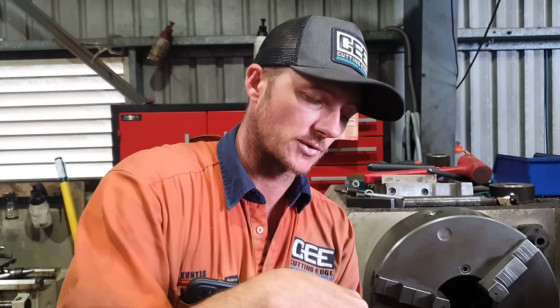The bridle that comes around the tool post to retain the tool holder onto it failed, it spat the tool, it wrecked the job, hurt the machine and hurt the guy operating the machine, and he wasn't doing anything out of the ordinary, just doing pretty standard work. After seeing that, I decided I would never own one of those. I wouldn't trust that on one of my machines, being that I do a lot of interrupted cuts, really heavy turning. They've got fatigue points, I'm a bit concerned about those, in my opinion. They're a light duty tool post, that's why I went with the dovetail style.